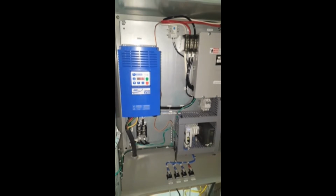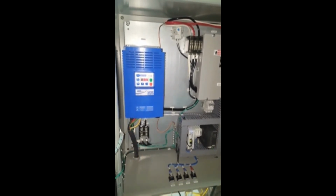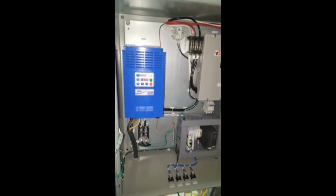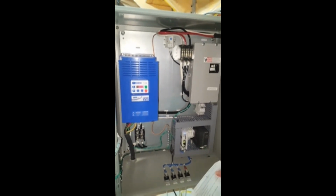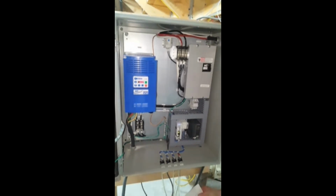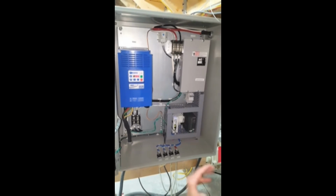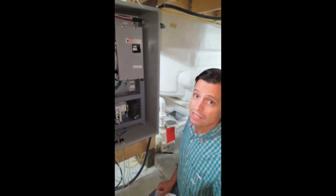Next step now that we've topped out, we want to go ahead and press that M Enter key. And it's going to show us what the frequency is right now. It's at 60 hertz. So right now, at top current draw, we're at 60 hertz. If the frequency is 60 hertz, you've pretty much completed the process. You do not have to edit it down, but we'll go on to the next step to show, if you were to check your frequency at this step and it was less, how to reset that maximum frequency parameter.